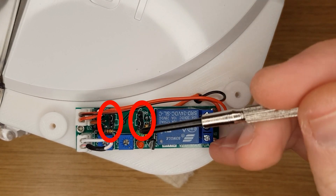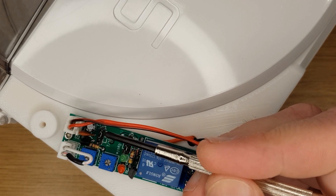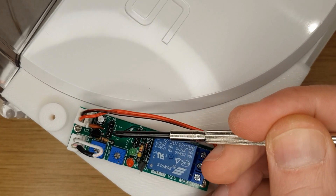There are a couple of jumper plugs on the relay board you also need to check. You want the one shown to be in the cycle position, and the timer pin to be in either position one to adjust between zero and three minutes, or position two for zero to thirty minutes. We'll set up the timing later once everything's reassembled.